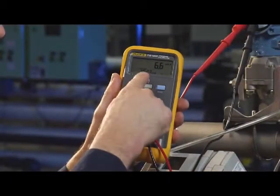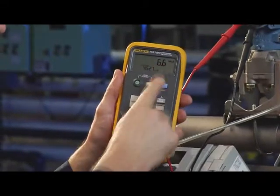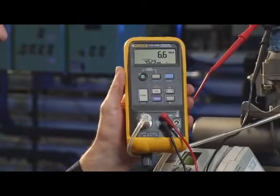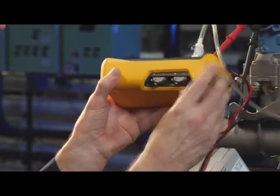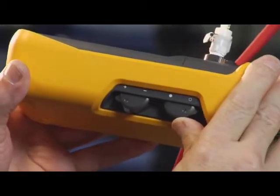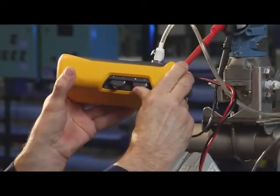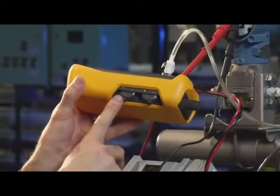Initially, we see the milliamp signal being measured and the pressure that's being applied. In the first step, we want to measure 0 inches of water. The best way to do this is to vent the atmosphere. We do that with these controls — open the vent valve. The vent valve can be opened or closed; open for measuring the 0 inches of water point.